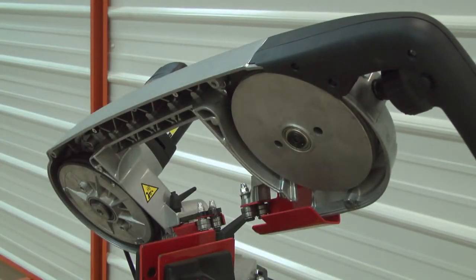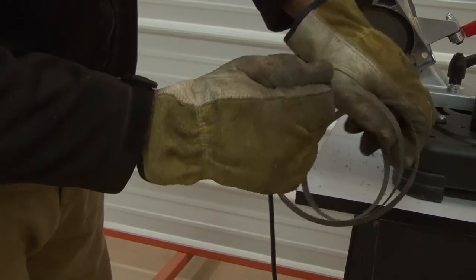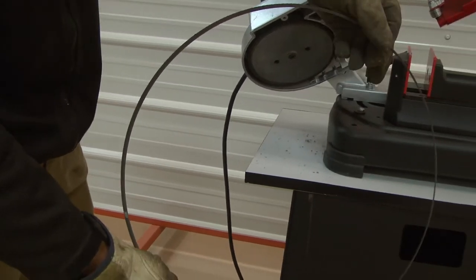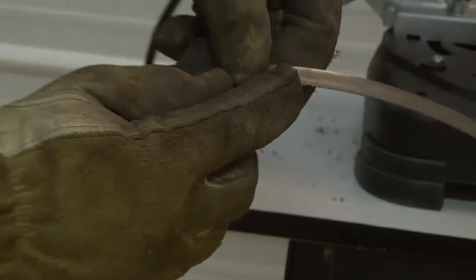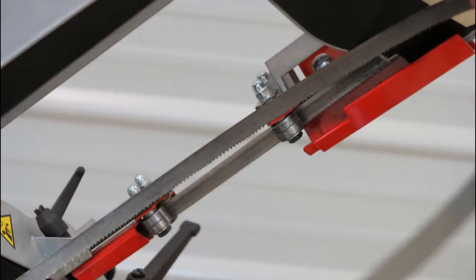An important note to remember is that the blades on any of the utility saw models that have the letters NG in the name have a reverse rotation on the blade. These are different from any other bandsaw manufactured, and for that reason, attention needs to be given to which way the teeth point when installing a new blade.